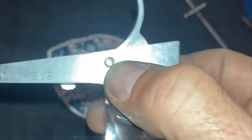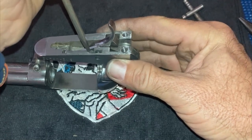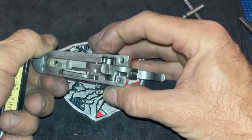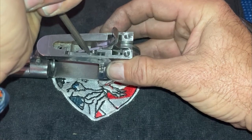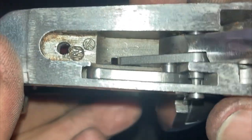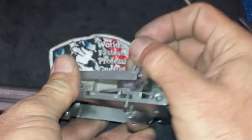This next pin is a little trickier to get out. Watch your fingers and thumbs when you're doing this. Hold the gun up — I've got my finger pushing on the back side of this pin slightly. I'm going to take a screwdriver — this is the load gate spring — push down on the load gate spring slightly and push that pin forward. See that notch in that pin? Now it's on top of the load gate spring. Now you can take a screwdriver and push that on out.